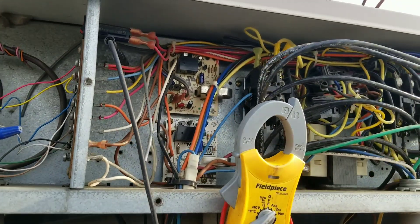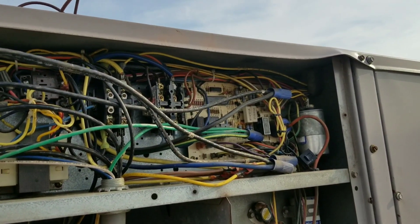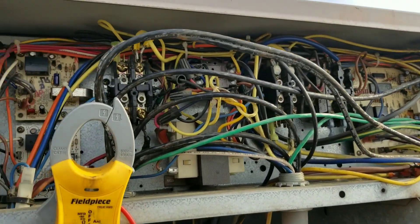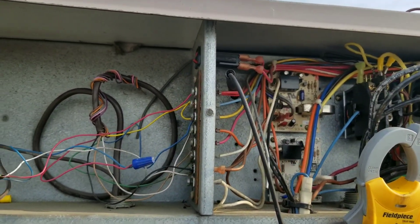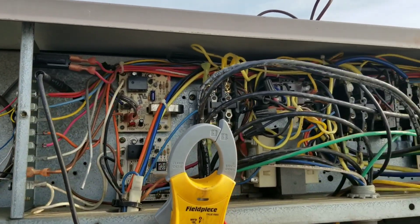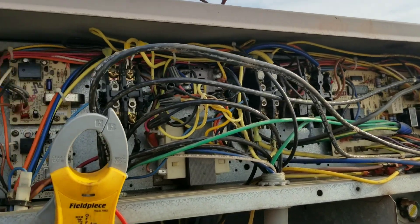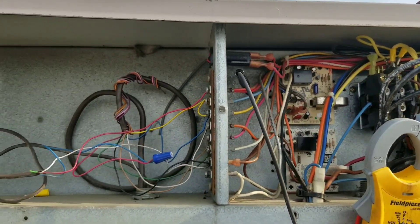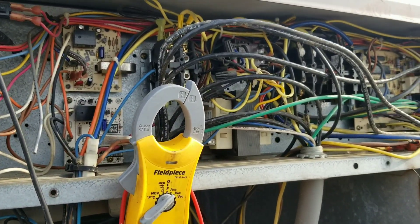To be honest, I don't know if when I jumperd that, that's when the fuse blew, or if it was like that already and I maybe coincidentally thought I caused the problem. But I'm starting to believe that since the system was already dead and my thermostat was dead downstairs, it was probably like that when I got here. Let me put this camera down and start doing some digging.